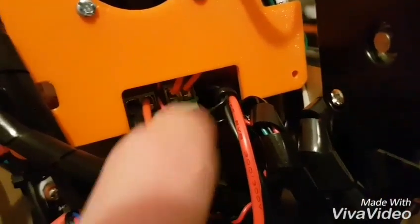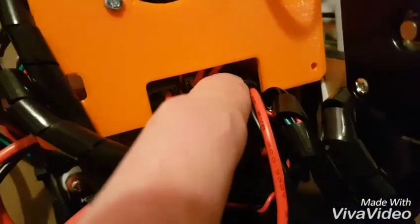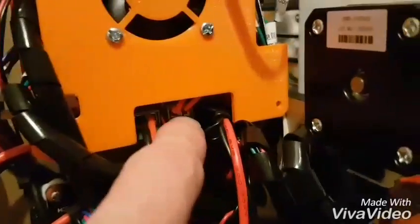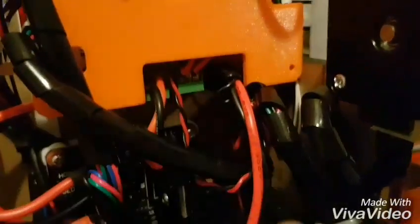It is not so bad with the external MOSFET, but definitely with the board terminals. They say they are rated for 10 amps, but I think they are cheap copies — that is why things melt. And that leads onto the MOSFET, and if you are going to do the MOSFET you might as well put the fuses in as well.